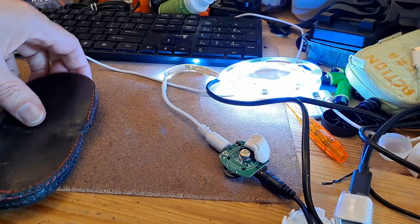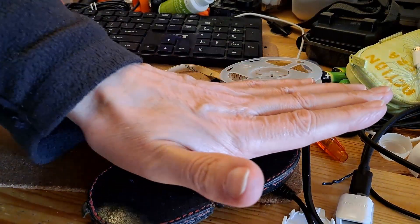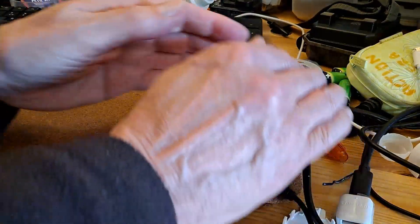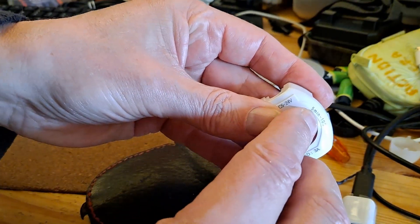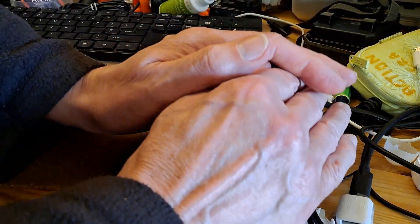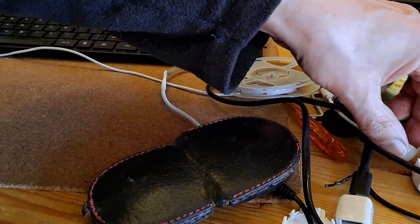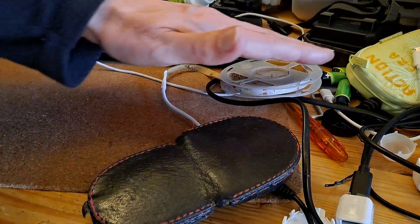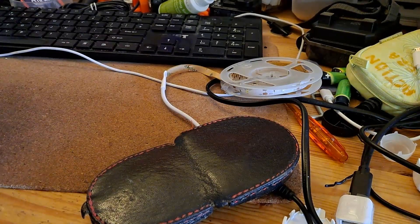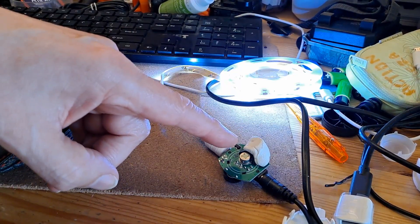This isn't going to go off now because I'm moving around and talking. If we cover it again, hopefully it'll go off in about five or ten seconds. Yeah, it's gone off. It's not going to see me again. So it just seems crazy sensitive, that PIR. And obviously it's not covered. Back to the original comments — yes, if I cover that LDR, it does work, but it just seems to be far too sensitive now.